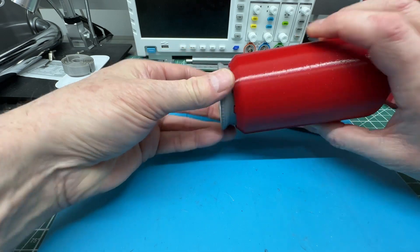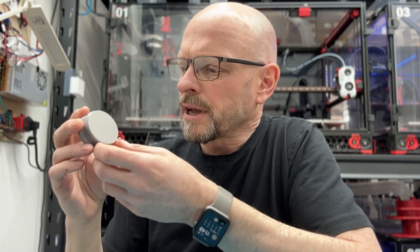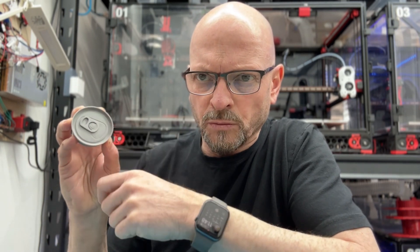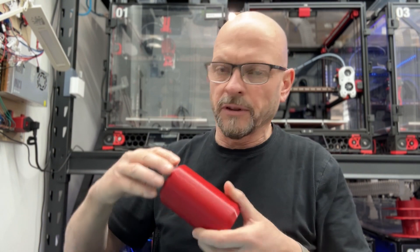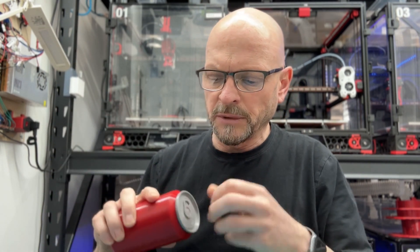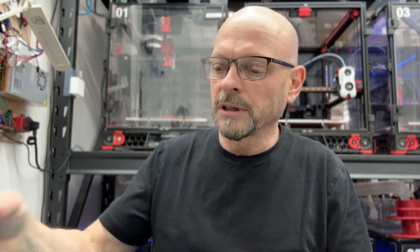When working properly, you can't turn the piece to withdraw the lock without pressing the button first. Once pressed, you turn it, the teeth retract, and you can back out the lid. When you close it again, the teeth pop back out and it's locked. I also designed a non-locking lid — it looks more convincing on top because it's printed bottom-down. It just screws on with no lock. If anyone is struggling with the locking mechanism, this is a simpler alternative that gives you a closeable container.